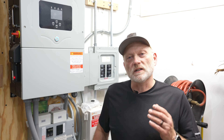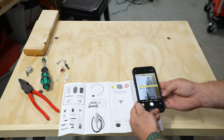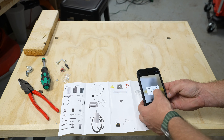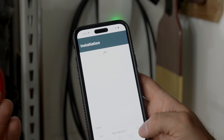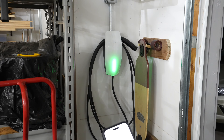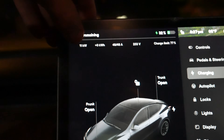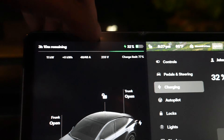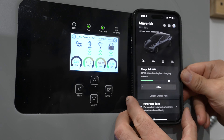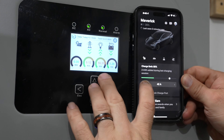Now that we've got the wall connector all hooked up and the circuits energized, we're ready to commission the wall connector using the Tesla app — that's pretty straightforward. There's a barcode on the front; we scan that and let the app walk us through the process. We're going through a software update right now. We've got the installation set up for a 60 amp breaker in the United States. We've got the green flash showing that we're charging, and inside the vehicle we can see 11 kilowatts charge rate, 48 amps, 233 volts.